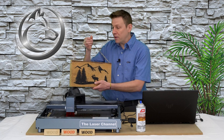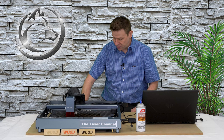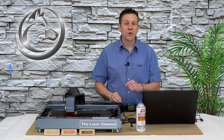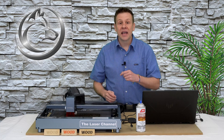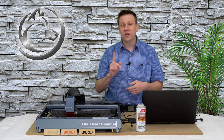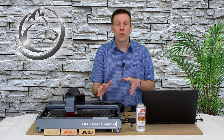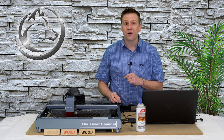For the next tip I'm going to move away from graphics and simple text and move on to one of the more complicated or more frustrating things that we could work on, and that is photo engraving. My tips for engraving photos are going to be more of a handful of things you could use to help get better success, and some things to shy away from. Because there are so many different power levels of laser modules and different speeds of the controller boards, these things have a big impact on what settings a person would use when engraving a photo.